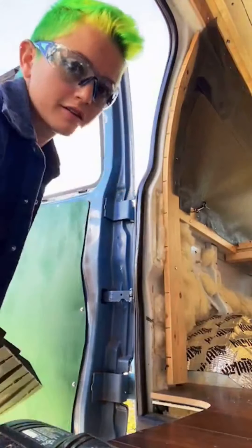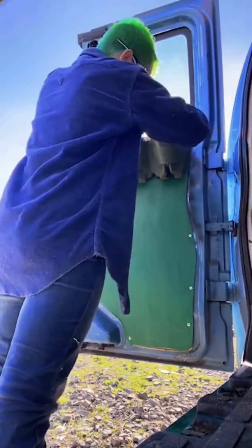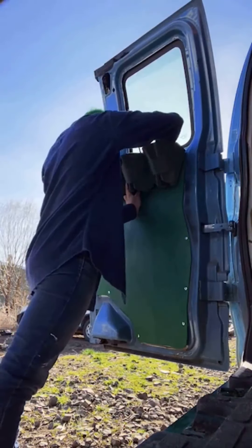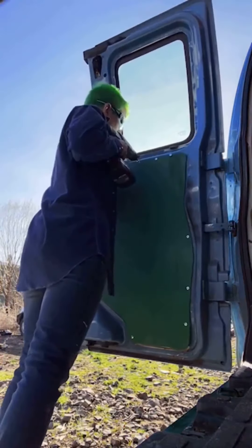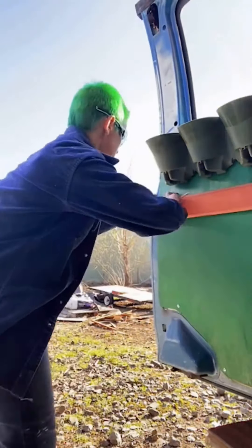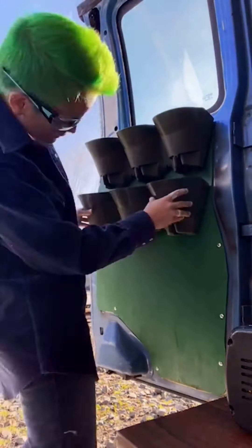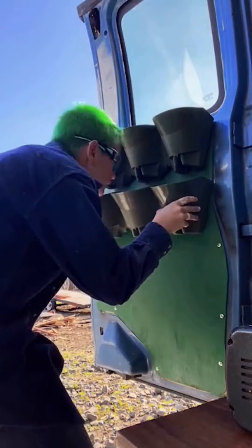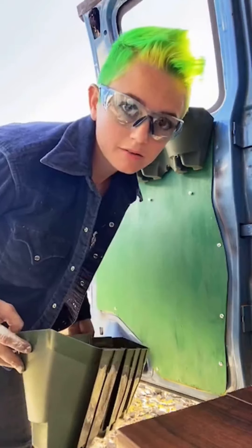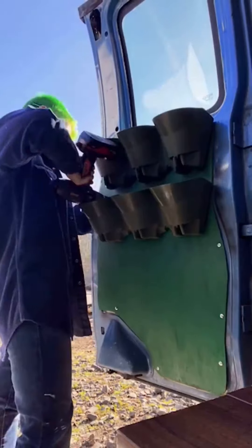It used to look kind of like that, and now it looks like this. So now it was finally time to attach the planters. I ordered them online from Home Depot — I'm about two hours away from the closest one, so when I can, I just order stuff online. I decided on three of them, and I was lucky — these fit almost perfectly in my door. What I'm doing here is marking out where I have that wooden support in the back, because otherwise I would be drilling into nothing and the planter would just tear right out. I was able to mark each point where I needed a screw by holding up the planter, marking it with a pencil, and then screwing in the screws and tightening them down.